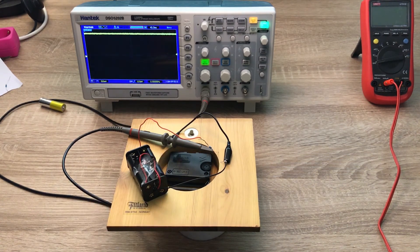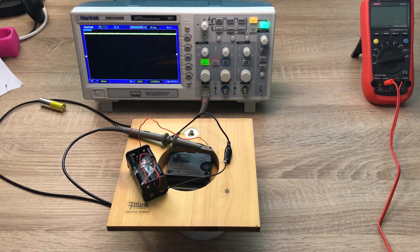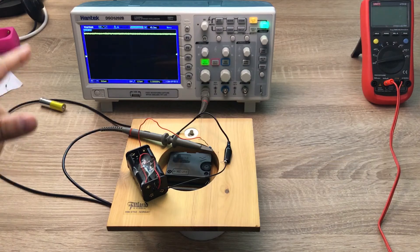This resistor is 33 ohms. If you use a bigger resistor the voltage drop will be larger and affect the measurement. If you use a smaller resistor the voltage drop is small and measurement is more accurate, but if the resistor is too small then since the current is very small the voltage drop will be too tiny to measure reliably on the oscilloscope.